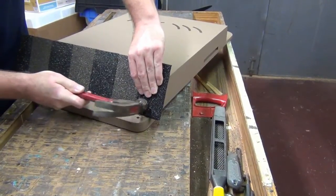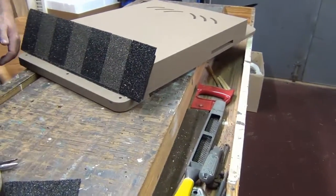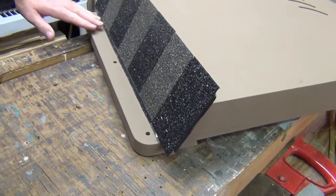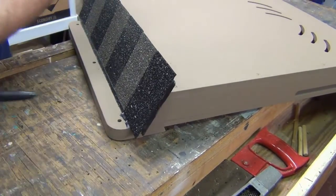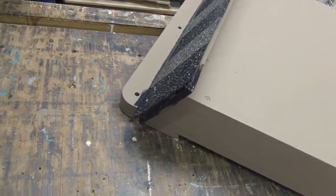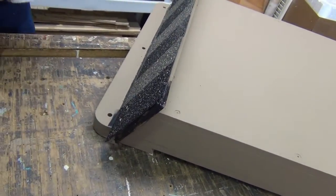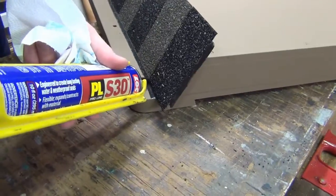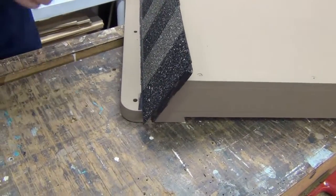That's not bad — there we go. That's back on and repaired. This bead I cut off square — you can see this bead that runs across here acts like a water seal and it makes it look prettier than just leaving it. Then just take your finger and run it. Use a paper towel to clean up. It doesn't have to be perfect — all you want to do is get it so there are no gaps where water can get in. And that's it for the major part of the repair. You can just let that dry.